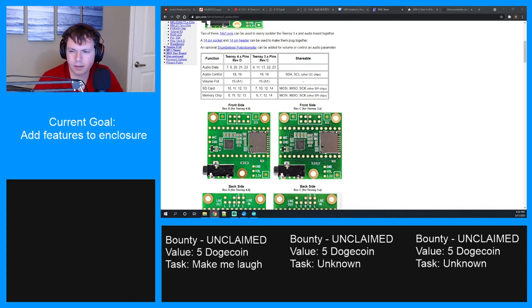Too much current from it might still work for now, but it is damaged. At least a 120 ohm resistor in line with the speaker for direct connection. Of course, it will not be as loud, but then you are not messing with that. For best results, you need a transistor and capacitor to connect to your speaker. Google for lots of schematics. Okay, so it really is just an output straight to the speaker. And yeah, you should use some sort of transistor thing, or maybe we can use an amplifier chip to make it loud.